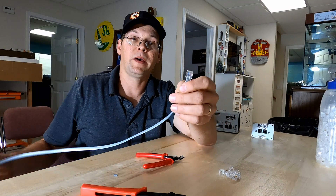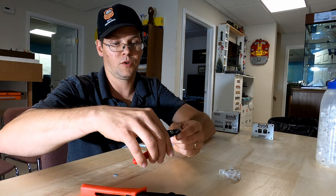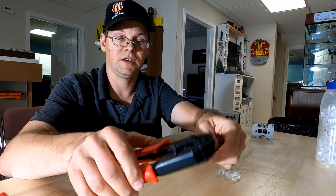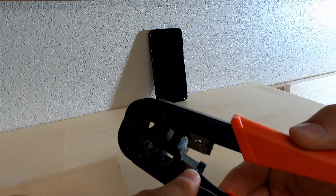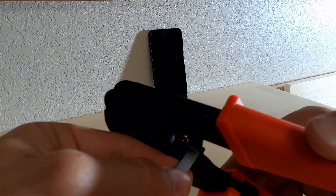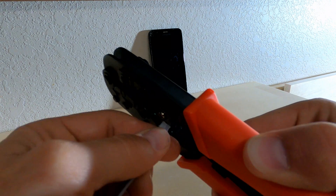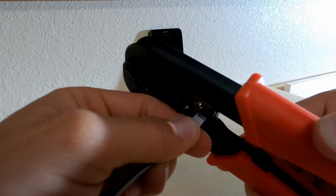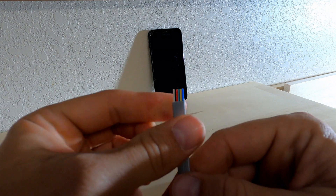What makes the LocoNet cable special is in how we prep the other side. We'll go ahead and make a nice clean square cut. On the stripper part of the crimp tool, it has a spacer where I can put the insulation just far enough, cut down with the razor blades, and rock it back and forth to peel that insulation out there, revealing the six wires.